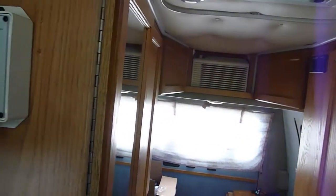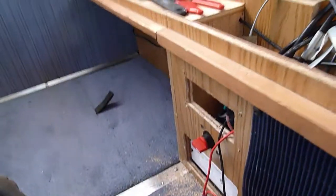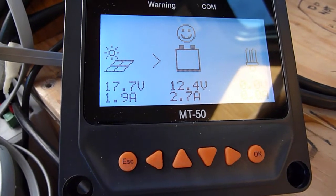The voltage is very low because the battery is run down to under 60% right now, and because I had to disconnect the power to plug everything in. I'm bummed out that I reset the whole meter — I've had that meter running for over two weeks with the power on. The solar panels are doing 17 watts, or 17 volts. I wonder what it's feeding the battery voltage-wise — it's showing 12.3 at 2.8 amps. It's not sending 17 volts to the battery, that's for sure. It just ticked up to 12.4 — maybe because the power is so low. The voltage going in should be 13, 14, 15 volts something like that.